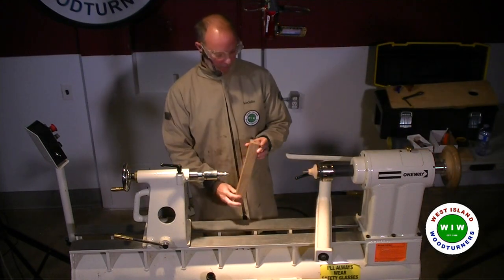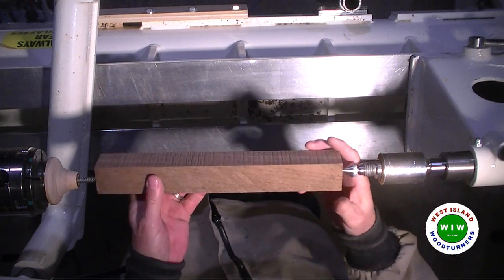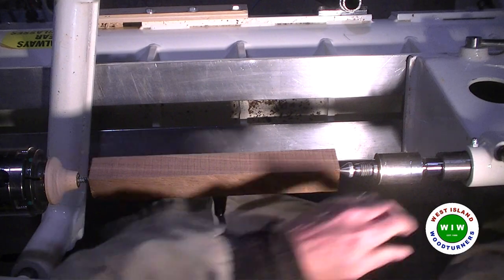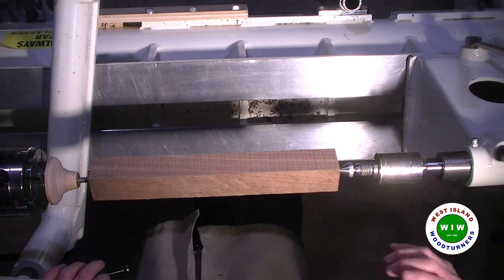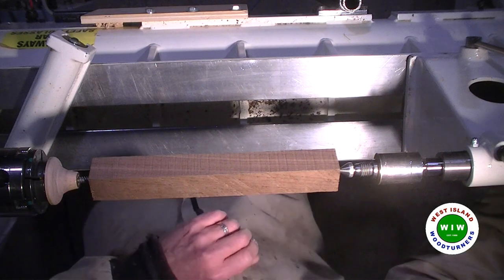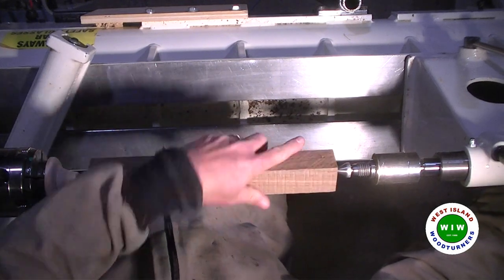Okay, so I want to lock the head in there because I've got to thread this on there, and it's a little bit of work to actually get that on there. So I bring this guy up like this, tighten him up just a little bit, put just a little bit of pressure on here because when it's loose, it actually does move in the ways, surprisingly. But any little thing to try to keep it going straight. So now I'm going to pull this while I'm threading it in there.